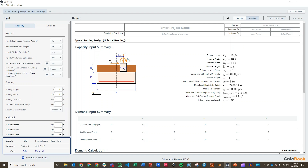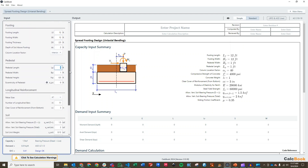There's also a question about whether you're going to use the friction coefficient or cohesion for sliding resistance, and a question about including the top one foot of soil in your lateral calculation — this has to do with the constraints, whether you have a slab or just bare soil above the foundation. You can talk to your geotechnical engineer more about that. Then we need to go ahead and start updating our footing dimensions: 12-foot by 12-foot footing, 2.5 feet deep, with 2 feet of soil. We'll leave the column location factor as an interior column.